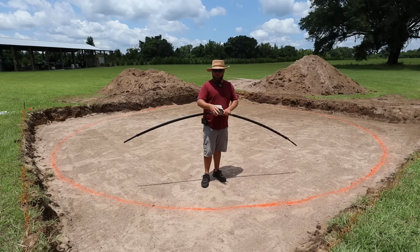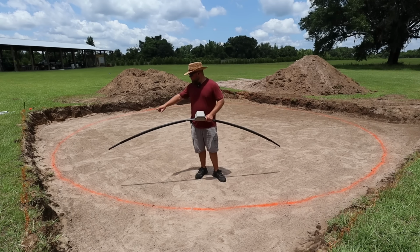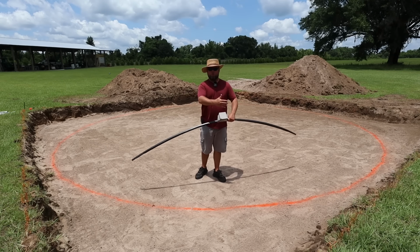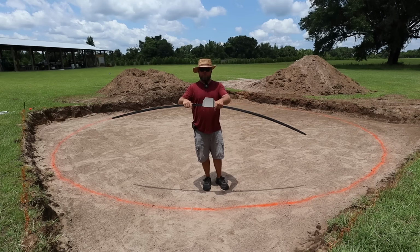It's almost kind of like the gravel, the dust, the concrete dust, things you put down for a road. It's not as strong as concrete or anything like that. You're not wetting it and forming it up strong, but it's a really hard compacting dust that you would put around this ring that's gonna give the wall some additional support on top of the dirt that you've already packed down. And go ahead and install this ring.